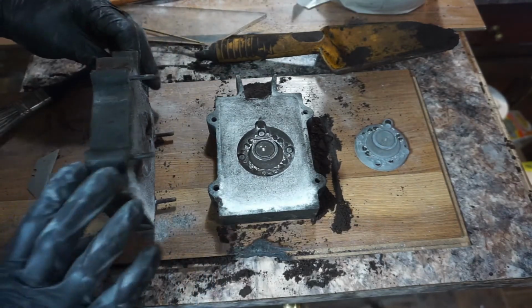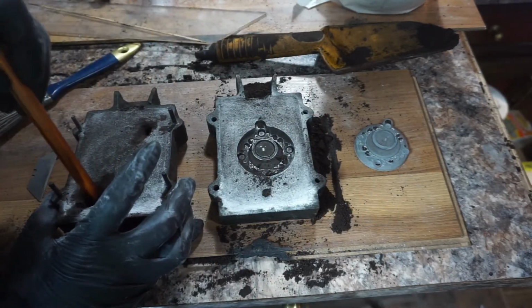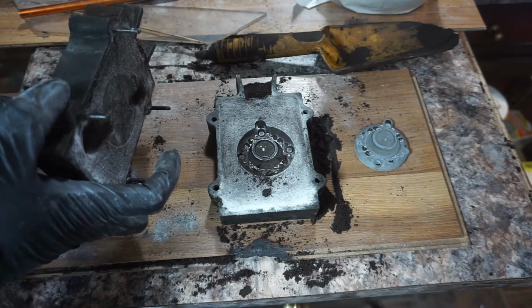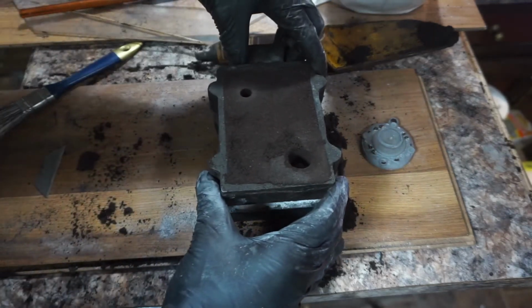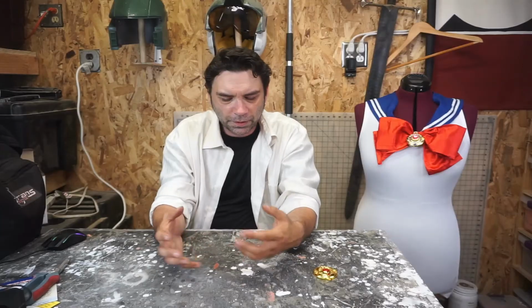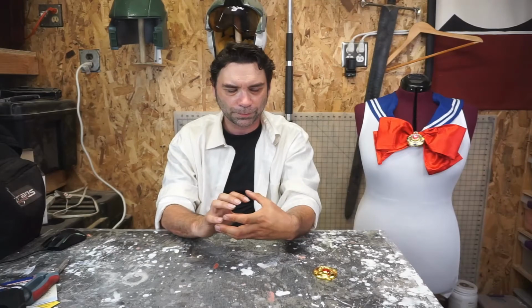The casting community refers to them as ingots. I'm always amazed at the fact that I can flip these upside down and mess with them and have no problems. It's just sand, right? That's molding. It's pretty interesting. Yeah, the Petrobond. It's oil bonded sand. It's gone through this really interesting chemical process, which makes it compactable, and it sticks pretty well. It needs to be refreshed every now and again. Kim uses 2-cycle oil for that. It's just kind of nifty.